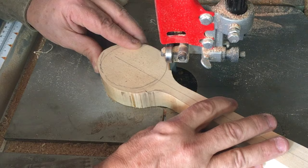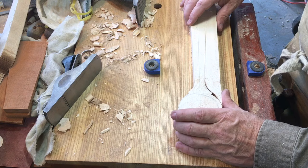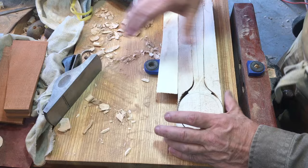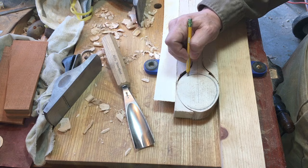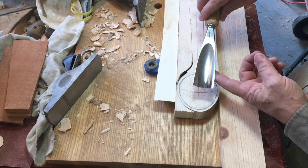Once I've nibbled off these two accents at the handle, I'll show you yet another use for the two pieces of wood already cut off this blank. We're going to begin carving the bowl of our spoon, and these cutoffs will help us secure the piece on the bench top using scrap wood and our bench vise. Next, I'll sketch out the rough shape of the bowl, giving myself about a 1/8 inch margin where the bowl meets the rim and the edge of the spoon.